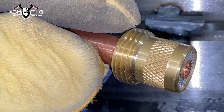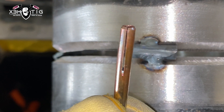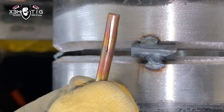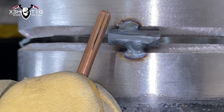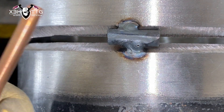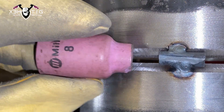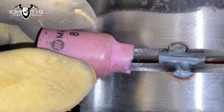Make sure your mesh is not damaged and is clean. Same with the collet — you don't want a collet that's warped from heat. The collet holds the tungsten and provides the flow of argon through the tungsten to your weld puddle. You want a nice, clean, straight, undamaged collet. A bad collet is a common cause of porosity in your weld — really important, especially if you're walking the cup or freehanding.